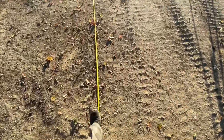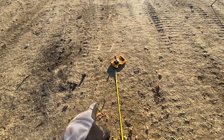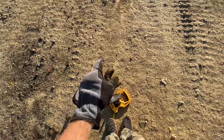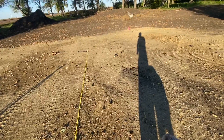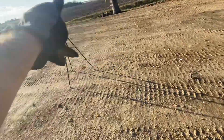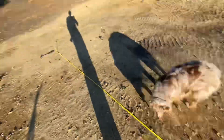47 plus 12 is 59, so I go over to 59 right here, and then the staircase will actually physically be right here. The utility room is going to start right inside the staircase. The staircase is three feet eight wide so I just went to four feet — that leaves us at 63. Somewhere in here is going to be our main drain down into the ground out to the septic. So we're at 63 feet. I'll go a little safe and get 70 to 80 feet of PVC — you can always return pieces you don't use. Getting the shopping list together so when the foundation is poured we can trench this all out and have our stub-up through the concrete for the septic.